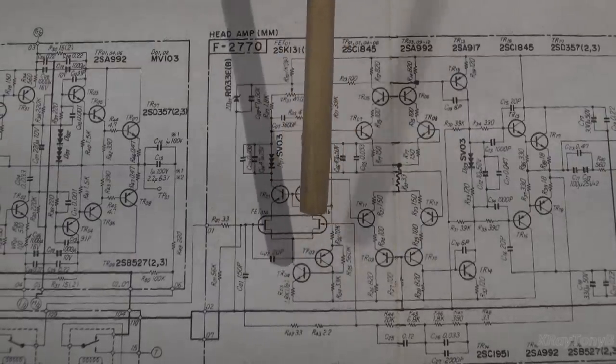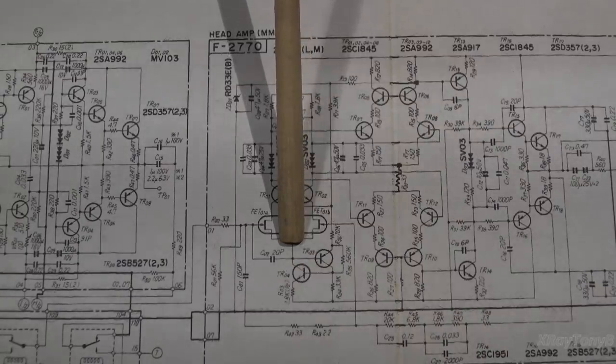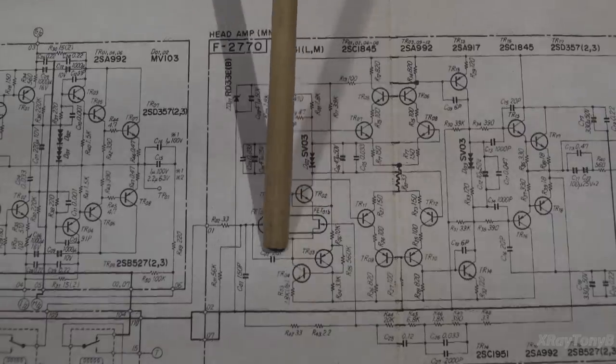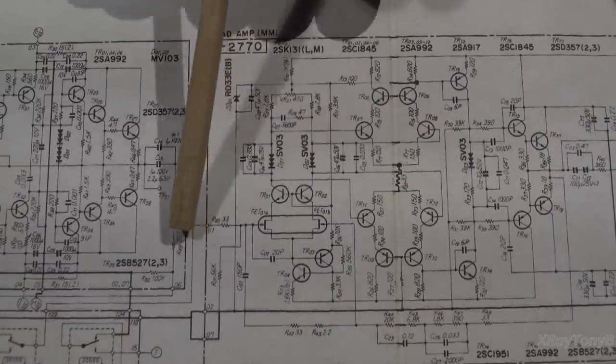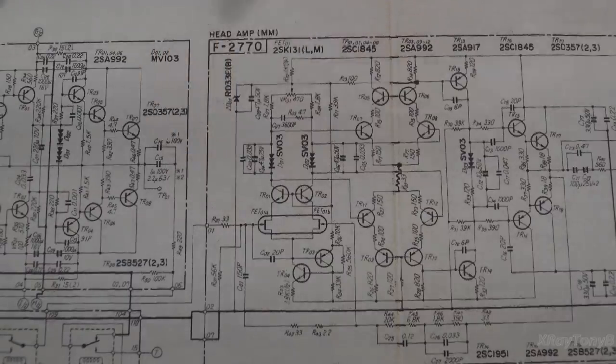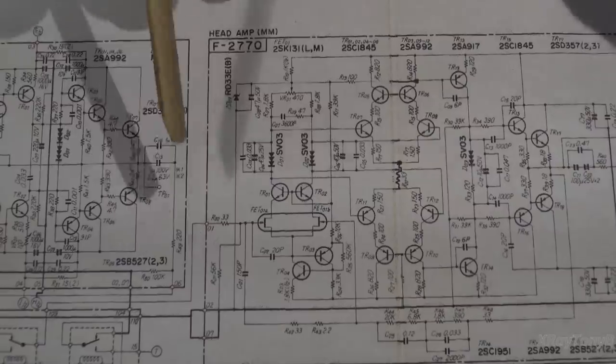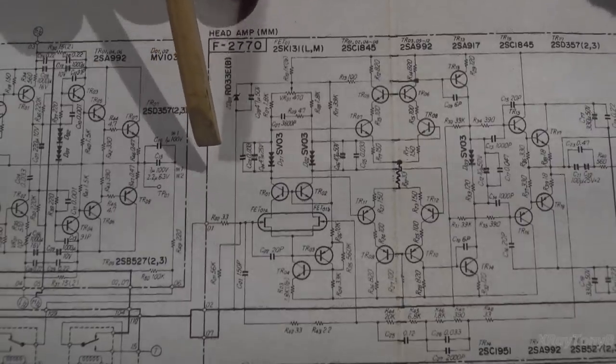The thing that they're trying to achieve by this, and again, this is all speculation, so jump in here and correct me when I'm wrong. But I think what this is all about is that different phono cartridges have a different sweet spot for their coupling impedance that they like, especially when it comes to capacitance and with the actual resistive impedance.